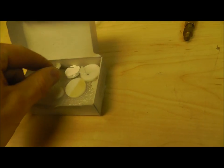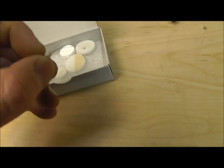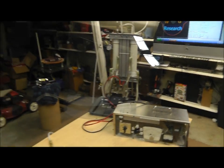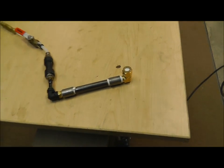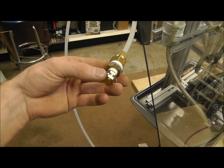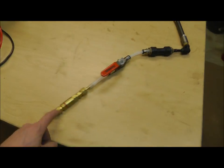Basically this is what they look like. They're very, very hard. I did break one though by testing to put it in one of my jigs to see how it would hold up. But you can see it's a lot thinner than the other one. I did some modifications and basically each one of these has a little bit different pattern in it. I showed you this before. Right now I've just got the split gas cell connected together, and I've just got one disc in here and it's just got one pin hole right in the middle of it. I've got a flashback blow-off here at 15 PSI that Chris got for me a while back, and I took my safety bubbler off for the moment.